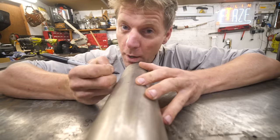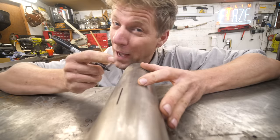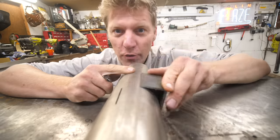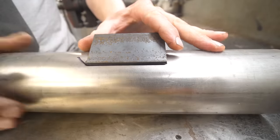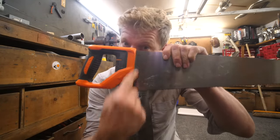Now, if you want to draw a straight line on a pipe, most of us just kind of wedge our hand up against it and drag it down. It's not bad but it ain't perfect — you should have a bit of angle iron on it. And if you can't find your set square or you haven't got one, but you do have a saw, some saw handles — this is a set square.